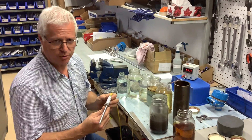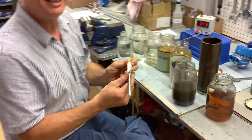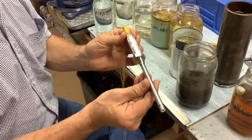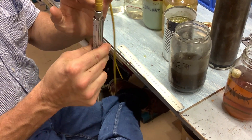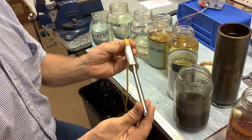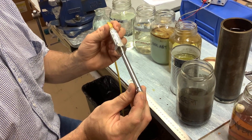Hello, my name is Mark from Intemco Controls and today I'll be demonstrating our LTX60 series level transmitter. This is a miniature version. It's got the electronics integrated into the housing. It's got a micro M12 connector, a 10 millimeter stainless steel outside sheath, and an internal probe of Teflon coated 1/8 diameter.